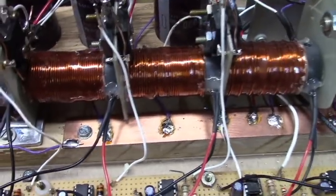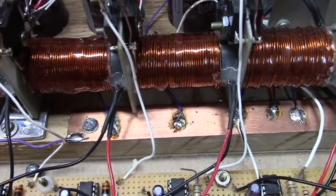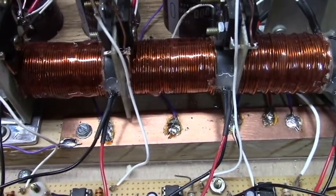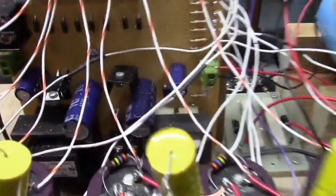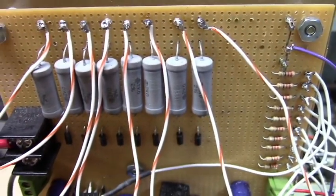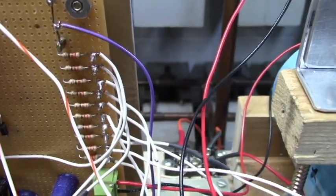The coils used are about an eighth of an inch longer than the previous ones, using number 20 magnet wire over the previous 22. There's the charging supply board, the isolation diodes, and charging resistors for the IGBTs. There is a row of current limit resistors for the infrared emitter supply.